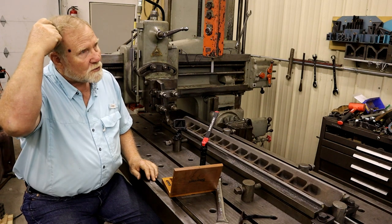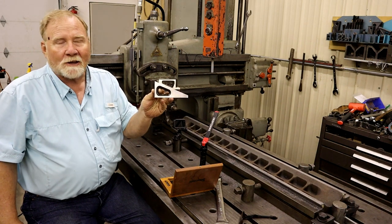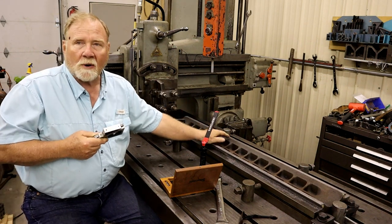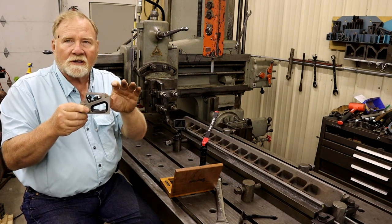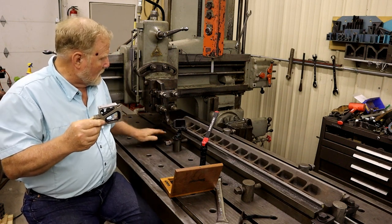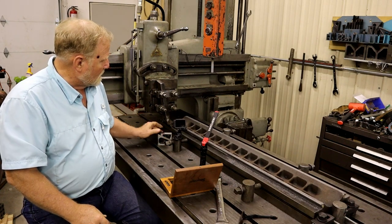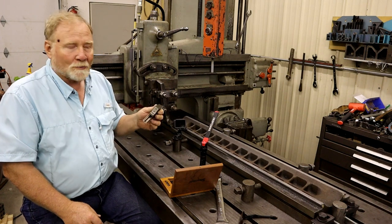And one guy asked me how I was going to do it, and I said, the tool for that is a planer gauge. Now, when I did that other side, before I took the tool out, I set this on the table and adjusted it to the exact height of the tool. So now I take and put this over here on this side, and I set the tool to that height. Kind of neat.